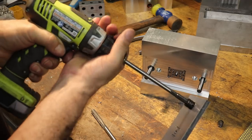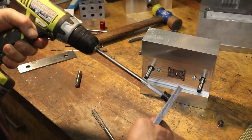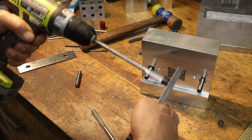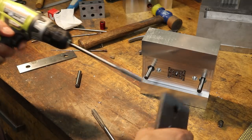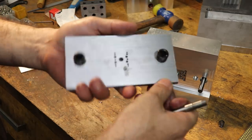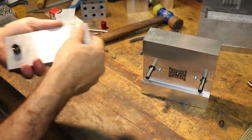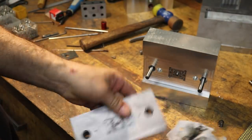I've got a kind of a weak hand drill here. I may have to go to a bigger drill. I'll literally just turn this by hand. Yeah, it's starting to poke through. Alrighty, let me see what I can do. All right, well, that wasn't pretty, but I got the rod to move in this bearing, and there's actually still aluminum oxide left. The reamer may be toast, though. And this guy, yeah, similarly. So let's see if our reaming job got our plate to, yeah, you can see all this black, probably remnants of the reamer. Anyway, I think reamers are kind of inexpensive.